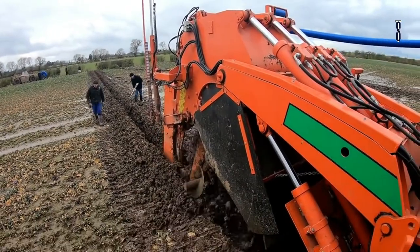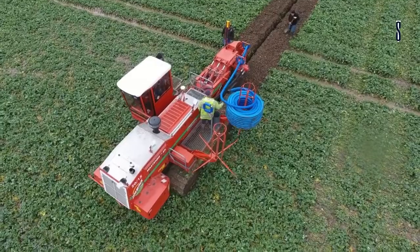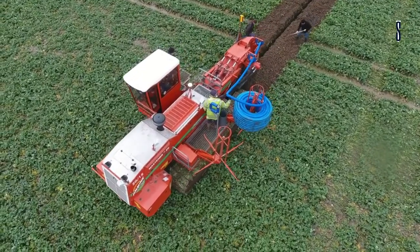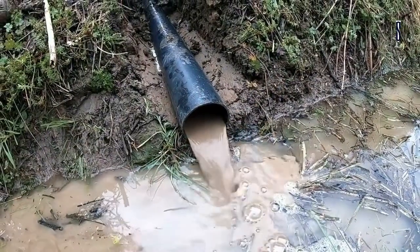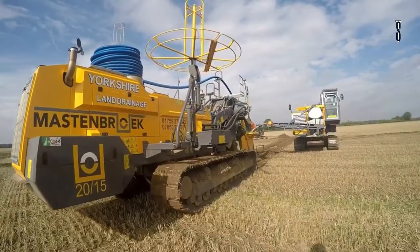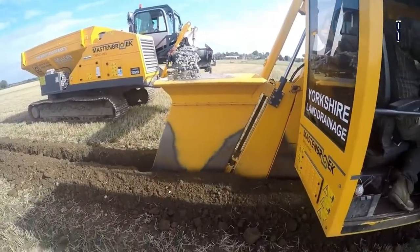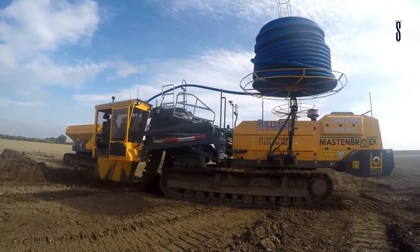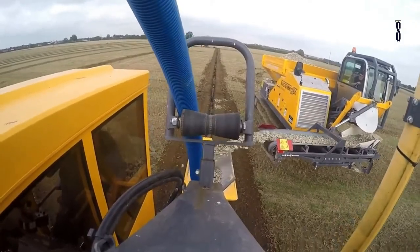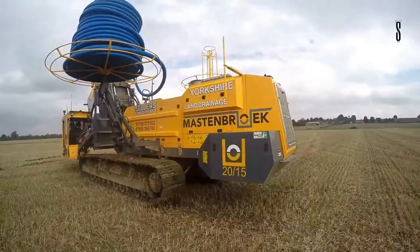This digging chain has a lower speed with a higher torque. It uses GPS and has a manual override for grade control. The trench depth is from 0.4m to 2.5m and a width from 125mm to 450mm. It has an auger on both sides for neat soil discharge. The pipe is pivoted using hydraulic lifts and manual or hydraulic pipe reels.